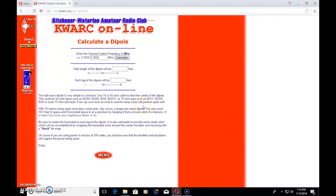So how long would a dipole be for the 80 meter band? It depends on where you want to operate. I only operate digital there, so looking at the lower frequency around 3.550 MHz — right in the middle of the digital portion — it looks like 131.8 feet. That's quite long. You'll see some dipoles out there that are compromised, covering 80 through 10 with coils or taps. My vertical is a compromised antenna — there's no way I could have a 65-foot quarter-wave full standing vertical. My vertical is about 31 to 32 feet, but it's got a tap and elements on top for 80.